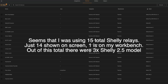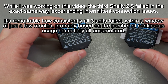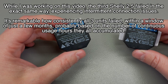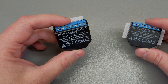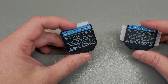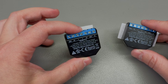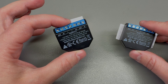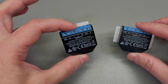These two were installed about the same time, about 4 years ago, and they failed pretty much within a couple of months of each other. The failure mode is that they no longer reliably hold a WiFi connection and there is a hissing sound coming from the inside. If you're an electronics engineer and you hear a hissing sound, you immediately think there is something wrong in the power supply circuit. So I'm thinking the PSU supplying the 3.3V rail to the ESP32 device inside is either bad — out of spec, cannot deliver the current, causing the chip to keep resetting — or it's producing high ripple that's affecting the normal operation of the chip.